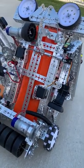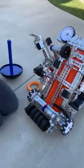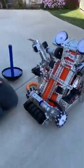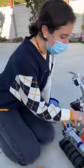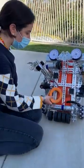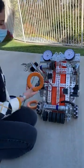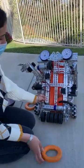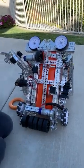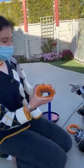Next, these belts and the donut did not have enough friction, which caused the donut to slide downwards. To solve this issue, connected to the crossbars, we have a bar. This bar gives the donut more pressure so it can go up with more ease. This bar also has enough flexibility, which allows a limited amount of pressure on it so it doesn't stop completely.